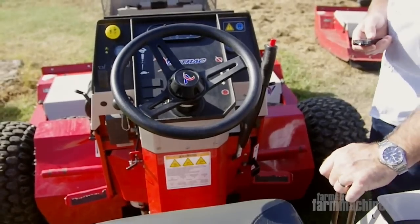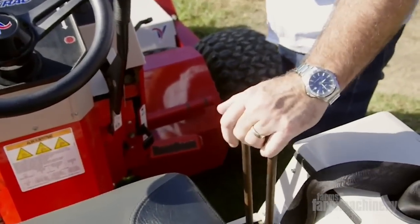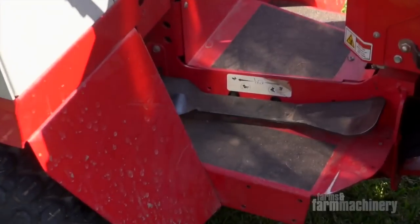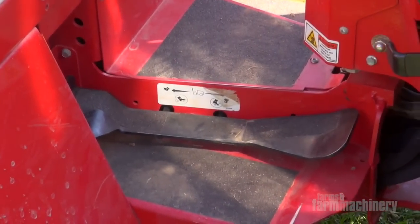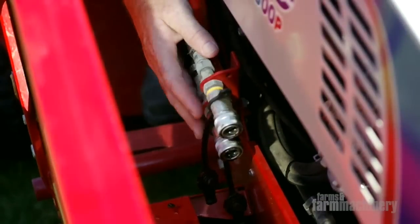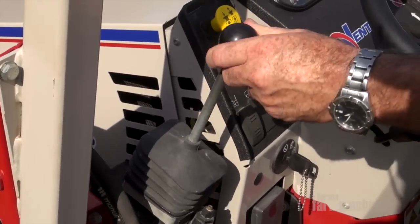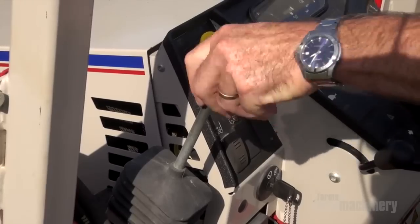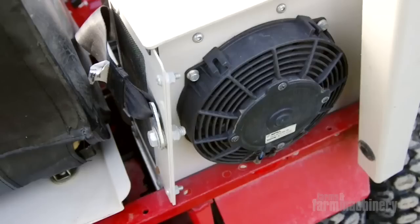On the right hand side there were two levers, just forwards and backwards, and sideways operated your hydraulics. There is a foot pedal for directional moves, but I found the hand levers much easier and more relaxed. The front end loader hydraulics plug into the set of remotes on the right hand side of the tractor, and the joystick for the controller then is on the front left hand side. It is a little bit of a stretch to reach. It might be nice if it just mounted a little bit further back.